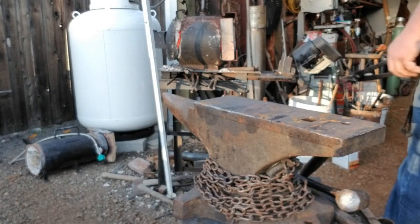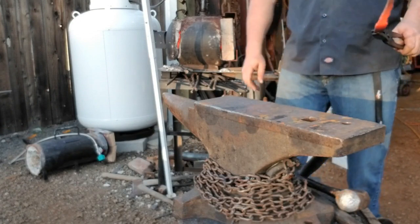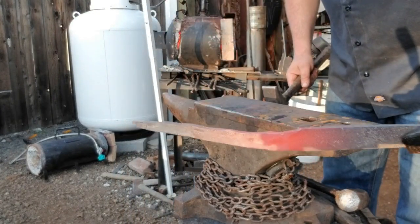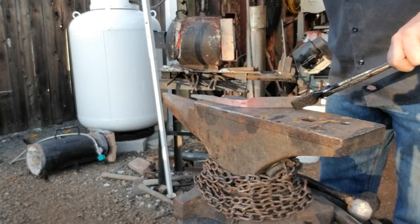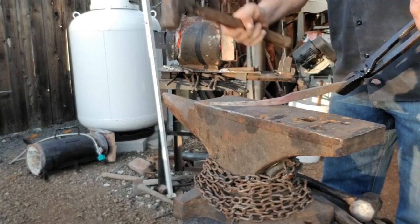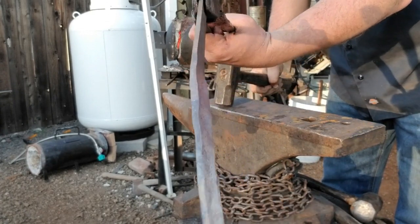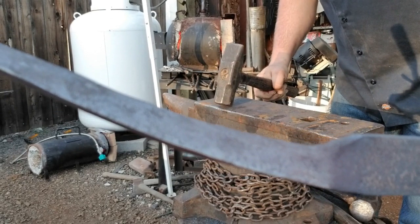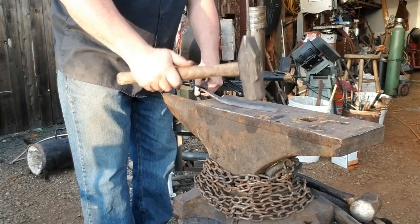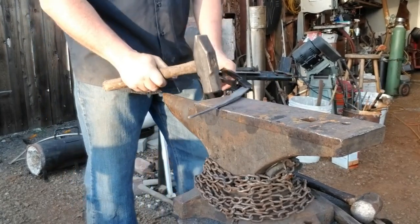I needed about two widths in my hand. Most knife handles are four and a half inches, but because this one has a bend in it and I want to continue it a little bit longer, I'm going ahead and hammering up a little bit more of a shoulder — all that's doing is getting me a little bit longer piece. I can still see it's pretty red. The shoulder's up a little bit narrower.